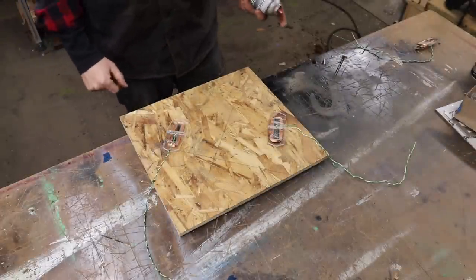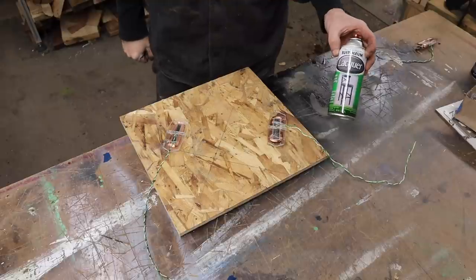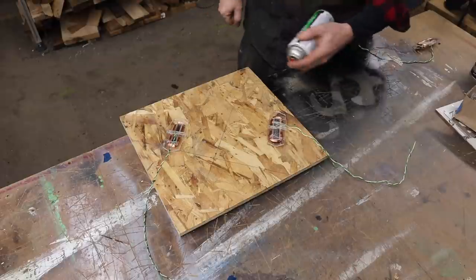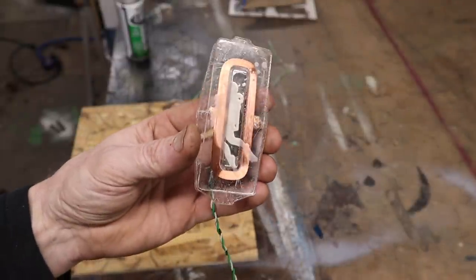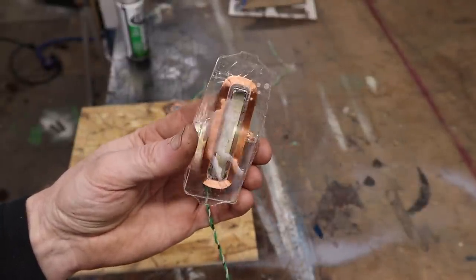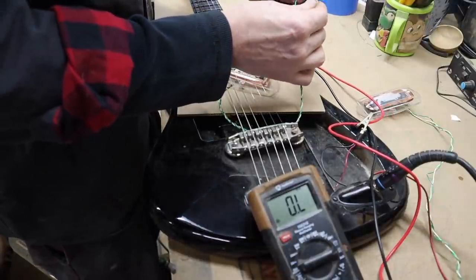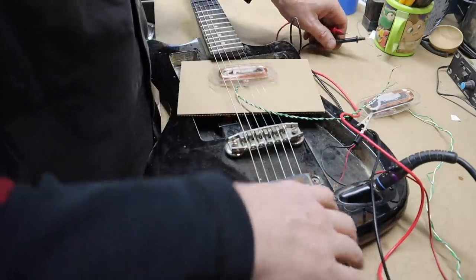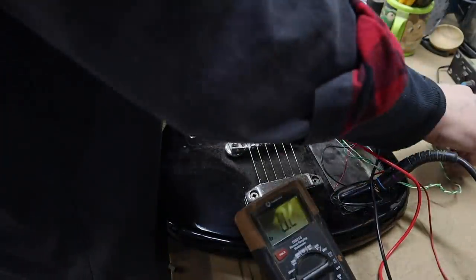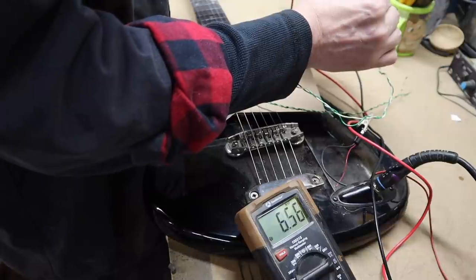Normally I would pot these with melted wax because it's more environmentally friendly and nicer, but I want to keep this acrylic looking clear, so I'm going to spray some lacquer around — trying to keep the tops nice and just get a little lacquer on those wires. By spraying that sloppy coat of lacquer on this clear thing, it actually added to that bubbly look. It looks almost like it's underwater — I kind of like it, it's a happy accident. Let's check our resistance: the neodymium one is reading about 6k, and the refrigerator magnet one is 6.5k.